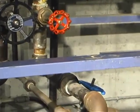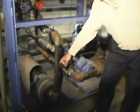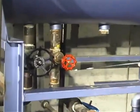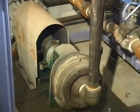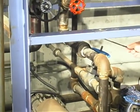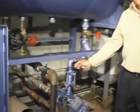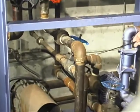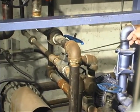The feed water enters the B boiler feed water pump discharge through the smaller line to boiler B, the small boiler. Also, both discharges are connected with the boiler A-B bypass valve, which is normally closed. In the event that either pump fails, we have the A-B bypass valve that connects the two discharges, so we can open that and put boiler feed water into either boiler with either pump.